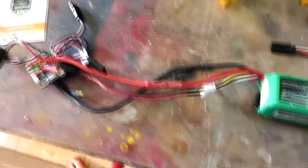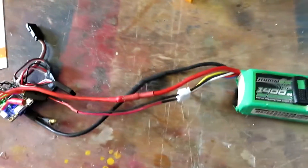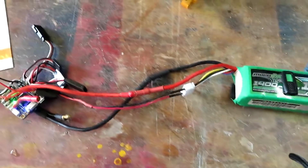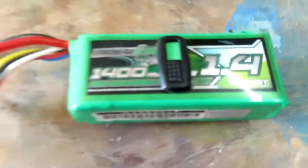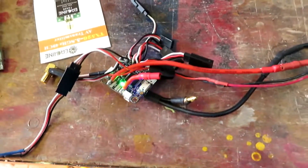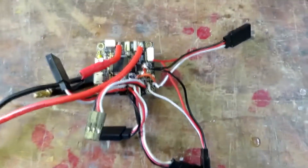Because of the way the board is set up, you get common ground all over the board, so ground is now passing through the main power wire instead of through that unconnected small wire. It actually works - no soldering needed. I've just turned the soldering iron off. You just have to have both batteries plugged in for FPV to work, which you'll have anyway. I didn't make a mistake in my wiring, I made a mistake in the battery I was using.